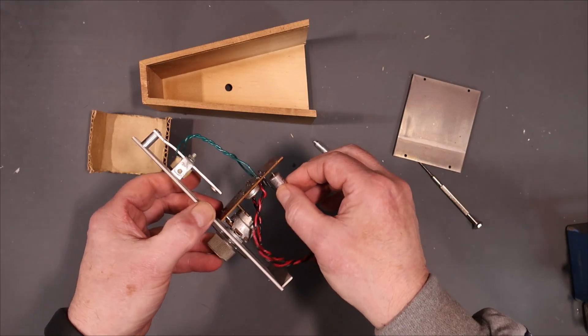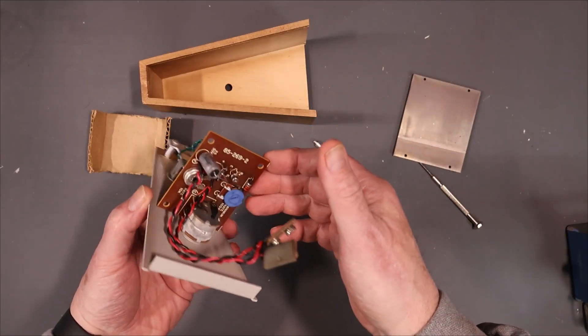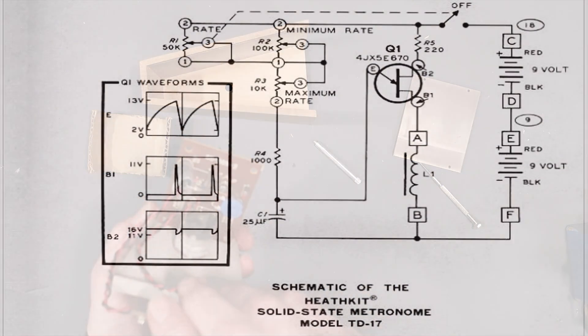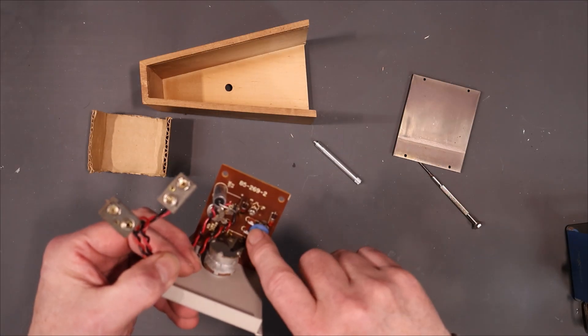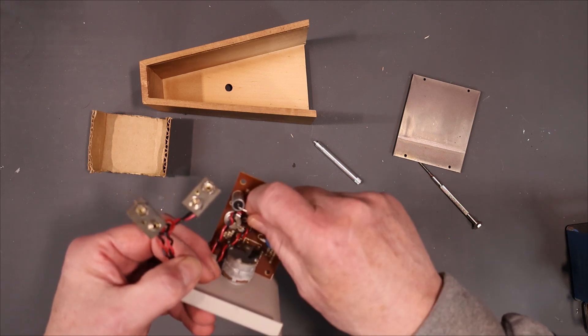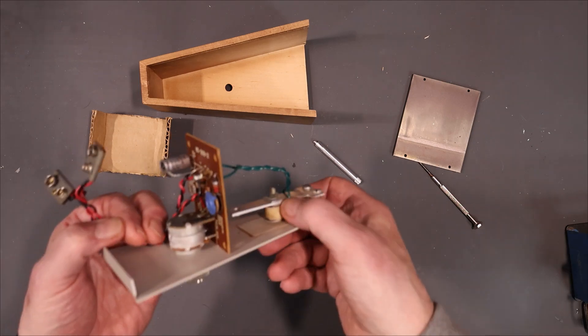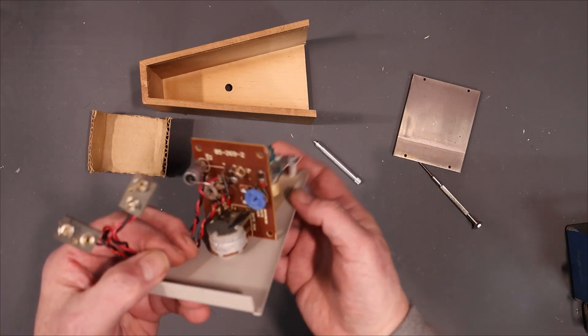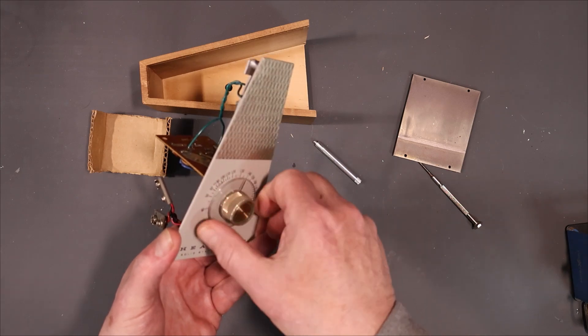Well, that could be it — it definitely would be it. I don't see anything else. It's such a simple circuit — it's just a uni-junction transistor, a little coil, a couple of variable resistors for the upper and lower frequencies. This is your timing device, this is the coil — the actuator itself. And this potentiometer just changes the speed, turns it on and off and changes the speed.